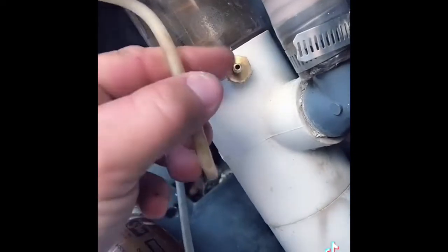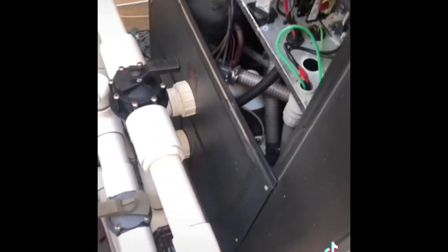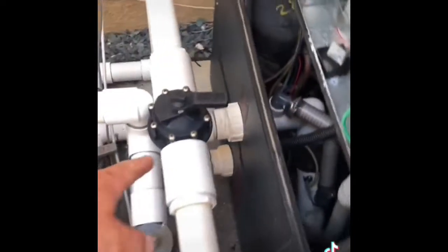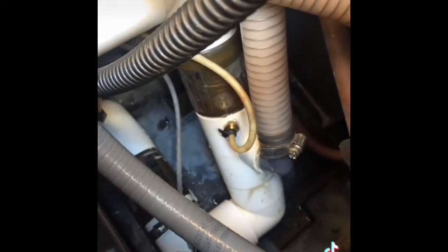Put a little bit of magic lube on it so it slides in. Alright, we got everything back up and running again — everything's connected. We've got our inlet water supply to the heater on, water's going in. There goes our connector — our two connectors actually — one on the left on the lower pipe, and our brass one that we just finished connecting. We went ahead and reconnected all the electrical.